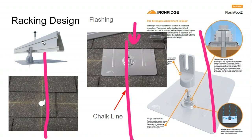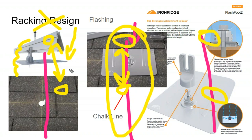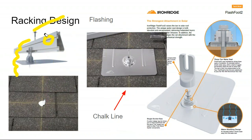And so I'll get up on the roof with my hammer, and I will start at the top of the roof, and with a wide-tip pen, I'll start marking where I feel the holes go. And then I'll go a few feet down, and without looking at this upper section, I'll start marking holes as well. If I do this in a couple of spots to see how good my hammer test is lining up, where I get really good hits, I know I'm lined up, and where I don't get good hits, I know I have to go back and pay a little bit of special attention to where that rafter is. Again, just to make sure that you're on point with your roof penetrations.